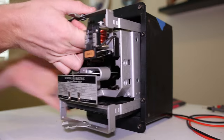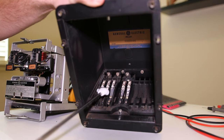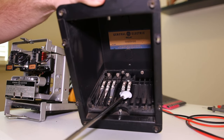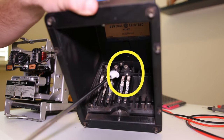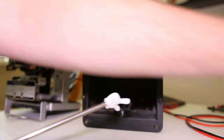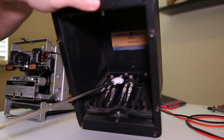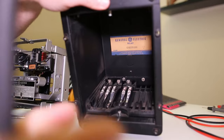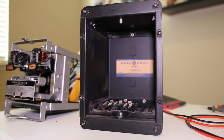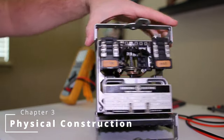These two little locking tabs - one on top and one on the bottom - unlock it from the case and the whole thing slides out the front. In the case, terminals one, two, and three come up to little lands for our trip circuit. Terminals five and six have a shorting tab - a spring-loaded piece of copper - so as soon as you remove the service paddle, it springs up and shorts pins five and six together so we don't open-circuit our CTs.